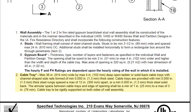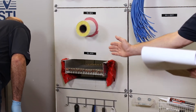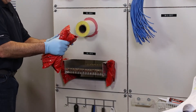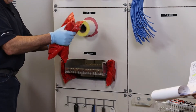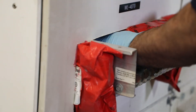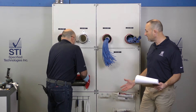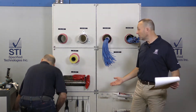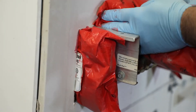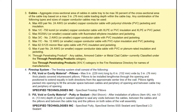Our annular space here is a minimum of one inch to a maximum of three inches between the edge of the cable tray and the opening — that's where Eddie's putting those pillows in right now. What I'm doing, John, is breaking the pillows down a little bit and keeping the seal on the pillows. The mineral wool inside makes breaking those fibers down a little bit easier — it's more malleable — and it's easier to friction fit those in there and get the compression we're looking for.